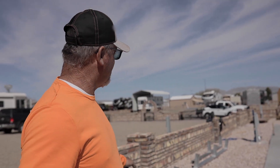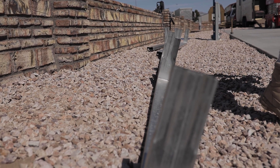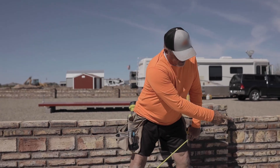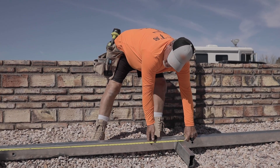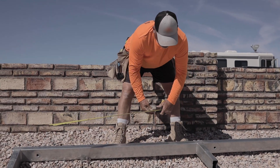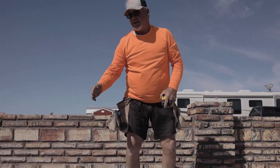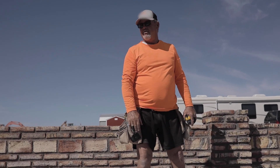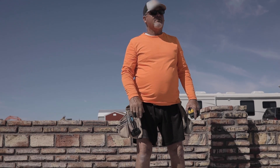You've got your starter base rails and your base rail extensions. I like these because if you're not sure what your spacing is, they have three that's welded on here so you can always check. You should be five foot or four foot to this edge — outside to inside should be five foot, or if it's a four foot it should be four foot. That is your starter. I know exactly what we're building: it's going to be five foot on center. We'll snap some lines, get these base rails drilled down, and start standing some trusses.